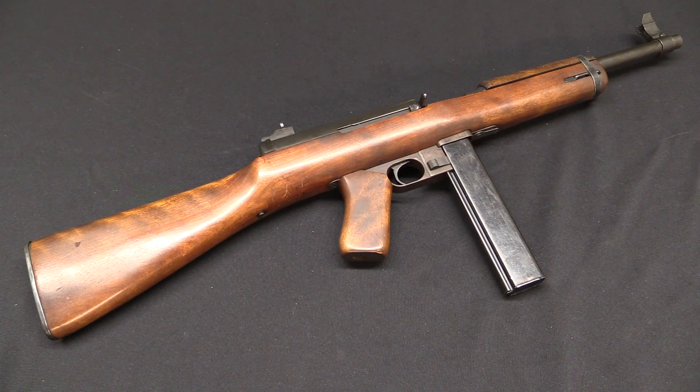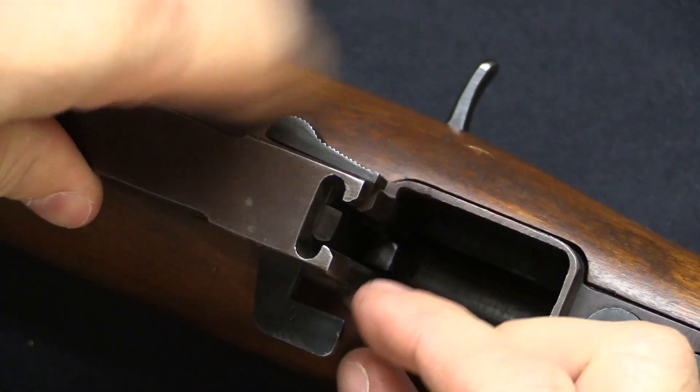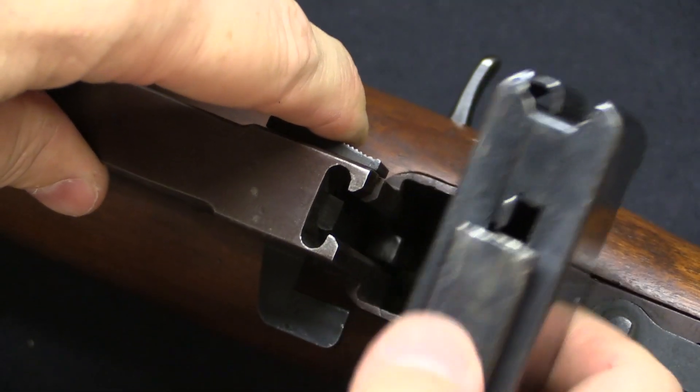It's interesting to consider this question in light of what submachine guns were being manufactured in the US at the time the grease gun was introduced, because not everyone took the same approach. There were people who looked at it and went, that does look like a good magazine, and we should continue to use it — referring to the Thompson. One of these is the M2 submachine gun. So the Thompson was the M1, and everyone's familiar with the grease gun as the M3. There was in fact an M2 submachine gun that came in between — an attempt to simplify and economise on submachine gun design. It's a fantastically rare gun today because the manufacturing process hit some real hurdles during tooling up, and by the time it was ready for production, it had been overtaken by the M3, which was a lot cheaper to manufacture. The M2 didn't have a milled receiver — it actually had a sintered metal receiver — but the same solid metal construction instead of sheet metal, and did in fact use standard Thompson magazines, because it would simplify logistics a bit.